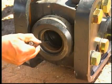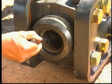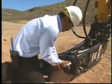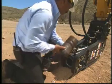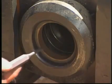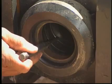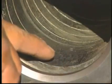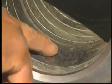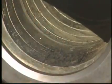After the tool has been removed and inspected, check the lower bushing for wear. The lower bushings on Caterpillar hammers are a slip-fit design and can be serviced in the field. Most hammer models have grease grooves inside the lower bushing. These grease grooves serve as wear indicators. If the first groove beyond the lower seal is worn away, but part or all of the second groove is visible, the bushing can be reused.